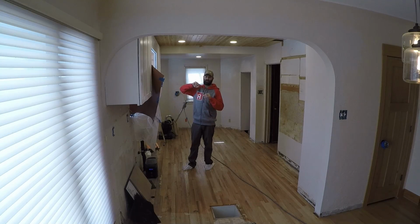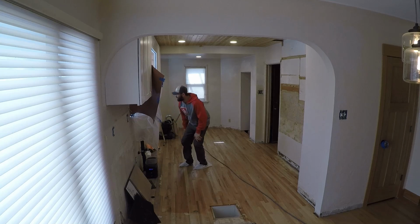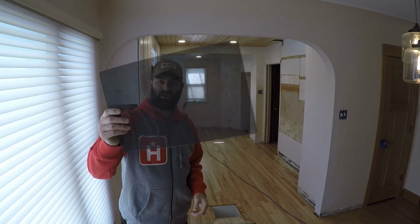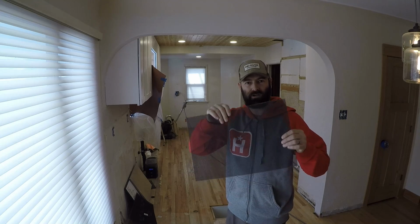I'm going to put the fan on, blowing out. Why am I choosing 100 grits? That's what the directions say. They give you a range, 80 to 100 or 80 to 120 for a certain cut. So yeah, 100 grits after the sealer. I'm going to go over the directions and the actual product up close and personal with you as soon as I'm done buffing.